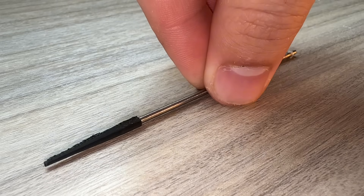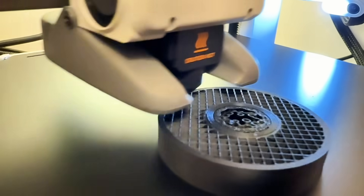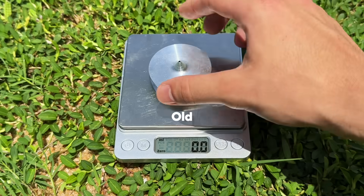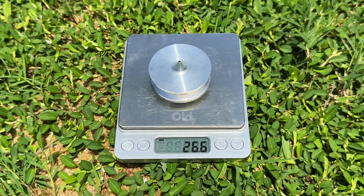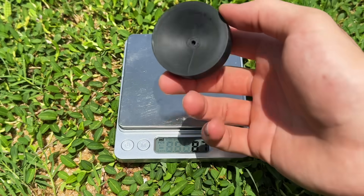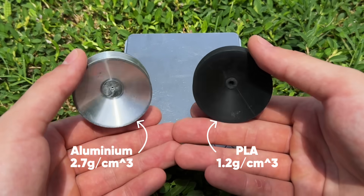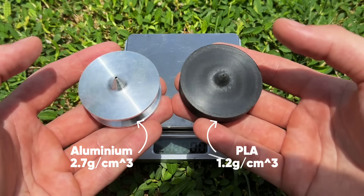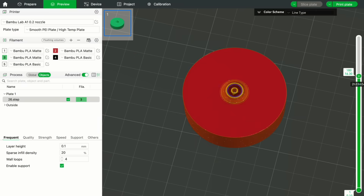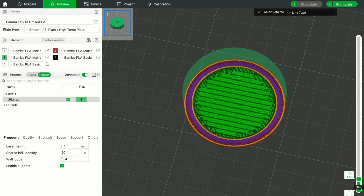What else are we changing? For one, I tried 3D printing the core. Using plastic in my tops is something I've tried to avoid due to poor mechanical properties, but when I realized this new core saves 18 precious grams, I decided it was okay. The reason the new core is lighter is twofold. Firstly, the PLA I'm using has a density less than half that of aluminium. And secondly, 3D printing makes it easy to hollow out the inside significantly without compromising structure or integrity.